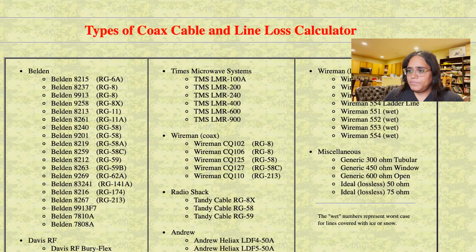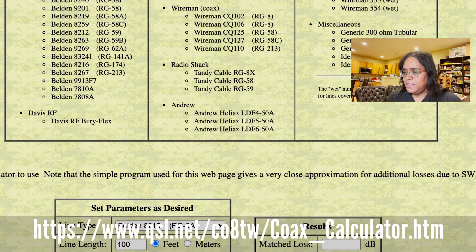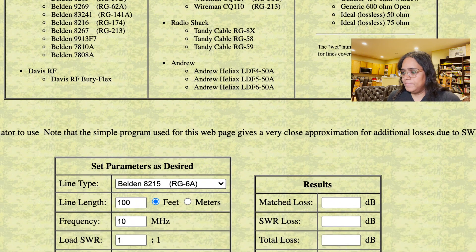Let's run the raw numbers. Here we have our coax calculator — I'll put a link in the description and also on-screen — and it tells you the types of coax you can calculate. Let's start with RG58 and assume a 50-foot length, because that's typically what you'd find where somebody has an antenna outside up on the roof. Let's say they have a dipole outside maybe in the trees — 50 feet from the shack to the trees.